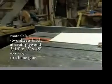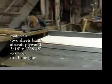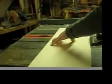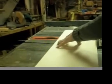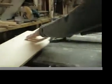We designed a board that's kind of an elliptical shape. It measures nine and a half by 32 inches. So we're cutting the plywood to a size of 11 inches wide and 37 inches long, so we have plenty of room around the outside to work with. We are going to be laminating and bending this, so we need some area around the edge or the perimeter of the skateboard where we can drive screws through the boards.